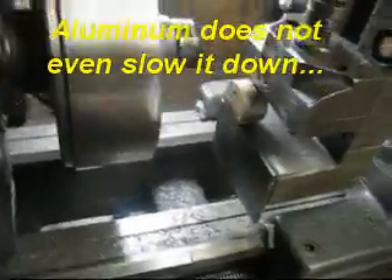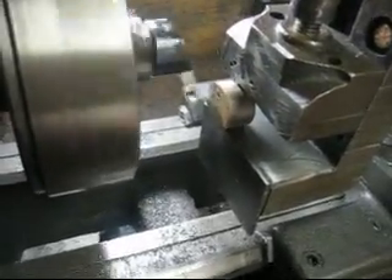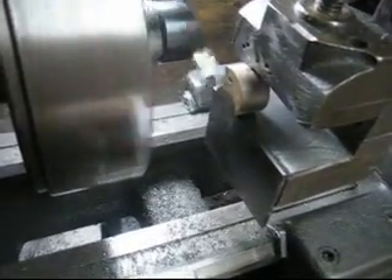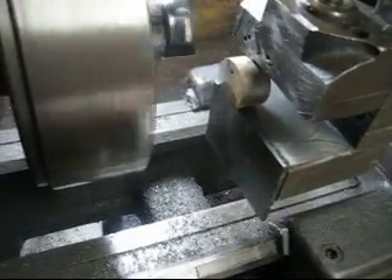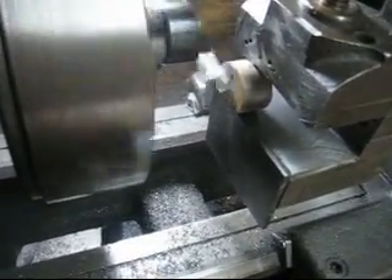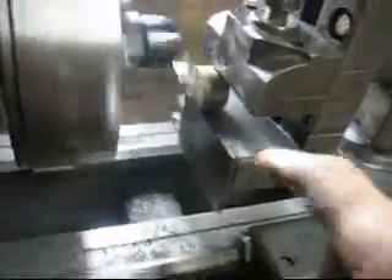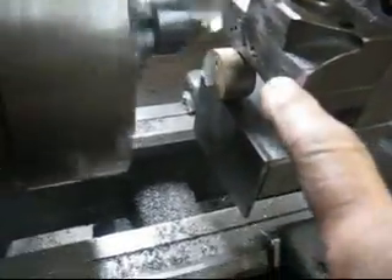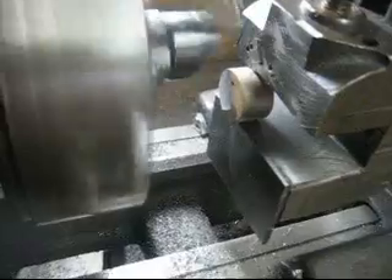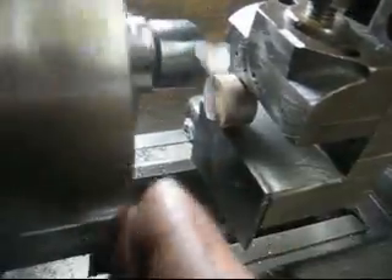There's a little piece of aluminum — a little piece out of the wheel cylinder. It's not clamped real good, just in there on that flat light. Turning that off is really nice — it's not even slowing down in the aluminum. I think I've got my good bottom jaw on here, but the top one is not quite square. So that's why it's cutting really more on the bottom than at the top — I think the whole thing is kind of twisted that way.